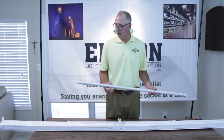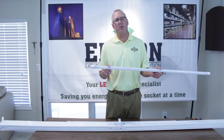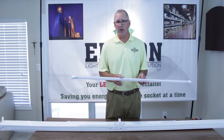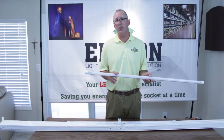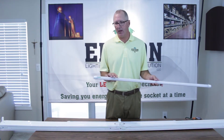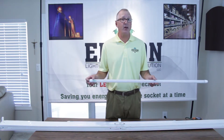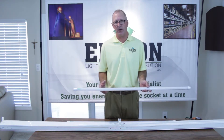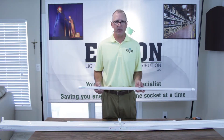Now we're ready to insert our four-foot LED tubes. Our tubes come with a five-year guarantee, they only draw 18 watts, are fully DLC compliant, and you're looking at over 2,300 lumens per stick — absolutely phenomenal tube. One thing about this tube is we can run it directly off of a T8 four-foot ballast, or bypass the ballast just like we're doing today with this eight-foot fixture and our retrofit kits supplied here at Edison Lighting Supply.